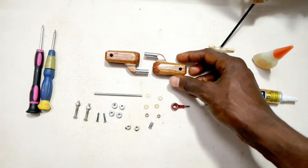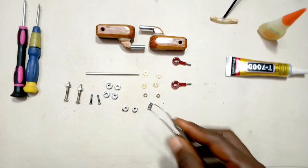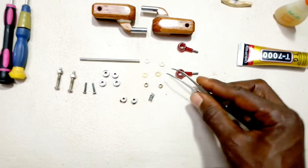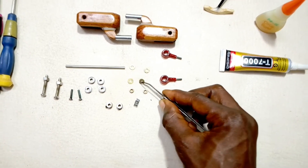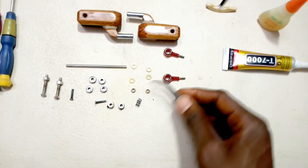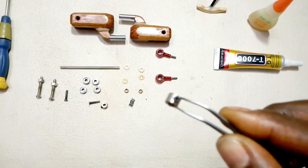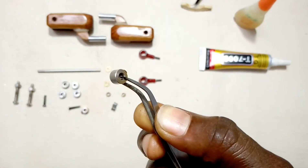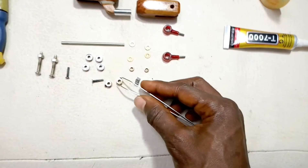I fabricated two grips for my wooden helicopter, which I'm going to fix today. These are the materials I'm going to use for the grips. These are the bearings which I talked about in my previous video — these are the four bearings I'm going to use today. Also, this brass washer I use as my thrust bearing. And this is the ring nuts — the lock rings — which I use for the shafts of the grips. This is the most vital part of the grips, which is the lock rings, because of the danger. It's a very risky mechanism and it has dangers due to the centrifugal pulling.